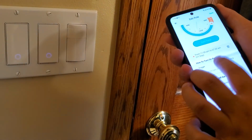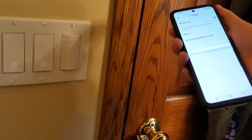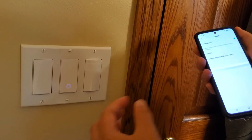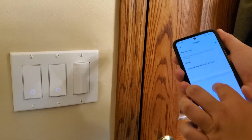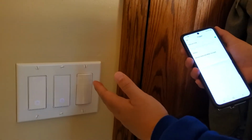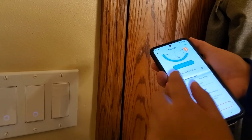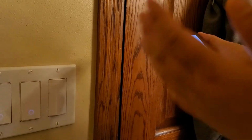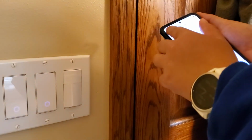Then at night, it's different. At night, say we all go to bed and in the middle of the night we go to the bathroom, we actually don't want to use this light. There's another shower light we can use so that it's actually darker in here. In that situation, I want the trigger to be manual only, meaning we will ignore the motion sensor. At night, you will have to click the button to turn it on. Even if the motion sensor detects something, it's not going to trigger the light, because at night we want to use this other light. And of course at night I put a timeout feature in there, so that if there's no motion for 20 minutes, it turns off. And of course the manual will always work. You can always click it on and off manually, like a regular dumb switch.